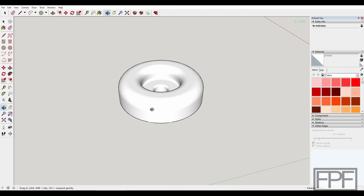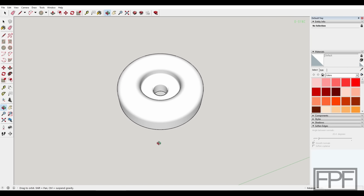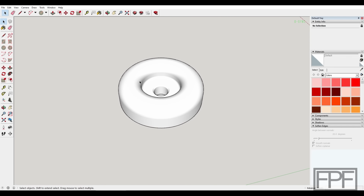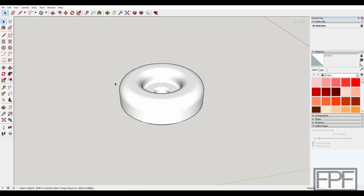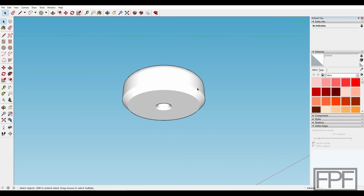All right, and here is the design that I came up with for this. I tried to duplicate the original design as much as possible with 2 changes. So the first change is the overall diameter itself is slightly smaller. I wanted to maximize the diameter because that just gives us more material to work with for squish. But I got back some additional space to clear that weld and the side by adding a nice thick bevel to the bottom. I entertained doing just a step portion, almost like a cutout on the side.